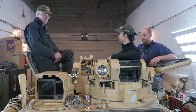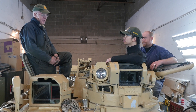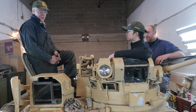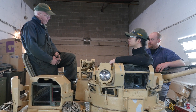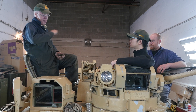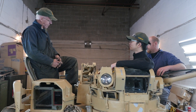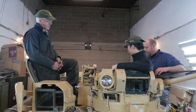I guess we've accomplished our mission — the ATGM launcher raises and lowers. It was easier than we expected. The main problem was simply that there was no oil in the hydraulic tank. After pumping the hand pump many times, pushing a lot of air through, it eventually came up very nicely. The bonus was the electric motor-driven pump — we thought we'd have more work, but it turned out the relay was just stuck. A tap with a blunt object freed up the relay, the button worked, the pump worked, and the rocket pod raised very well.